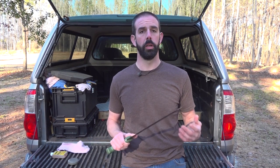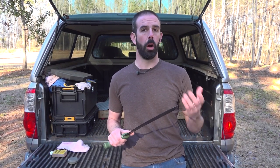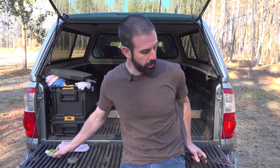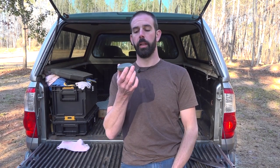In our time out here clearing, we've really worked these parangs, mattocks, axes — anything with a blade is going to get dull. You're going to hit rocks, hit hardwood, and it's going to roll the edge over. You don't want to put a super fine razor edge on heavy-use tools because that edge is so thin it just rolls right over when it hits anything hard. You just want a good working edge on it.